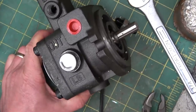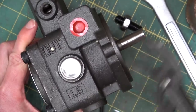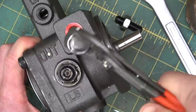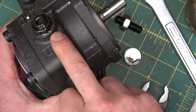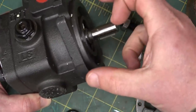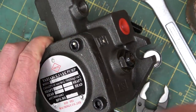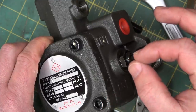We see an interesting artifact of the manufacturer here — a load sense line. This casting is good for different models of pump, but what we actually have here is a displacement limiter. This guy limits the displacement of the external ring. Very, very smart because it's so simple.